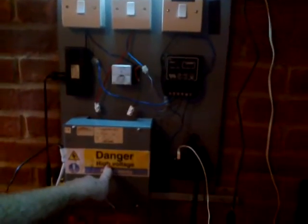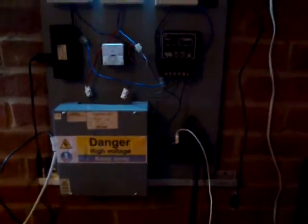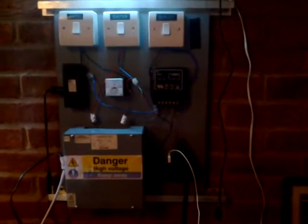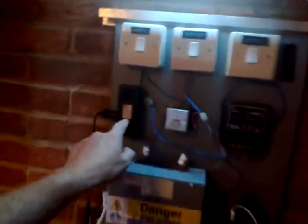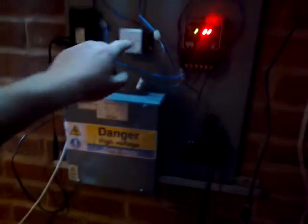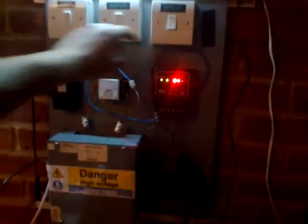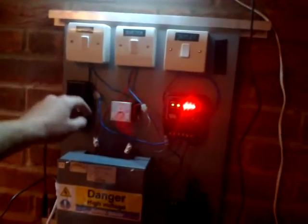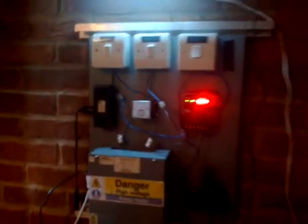I've got a load of these blue LED ones spare now - I'll use them for something else. In there I've got a 17 amp hour, 12 volt battery. Four screws, the batch comes off, and the old system slides off the wall - same with the panel, which is just temporary on the roof so I can pull it down and take it away if needed. I've got three sockets here for power coming in but I've only got one panel plugged in at the moment, and that's all I need to keep the system afloat. I've unplugged all the lights because I had to charge the iPhone, and the iPhone uses quite a lot of power compared to, say, the big old Icom sideband radio.